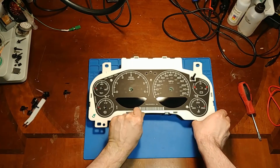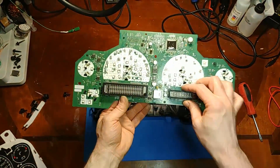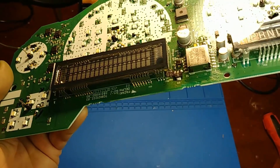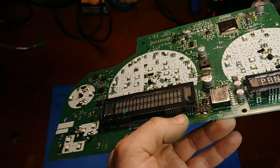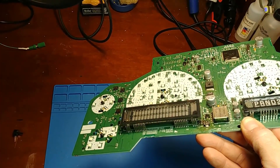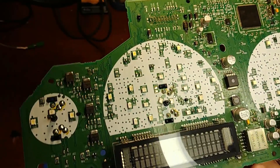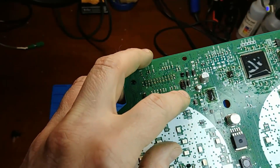So yeah, this is going to be another vacuum fluorescent display MOSFET issue. Let's get down in here. Besides a hole, we do have the MOSFET like he mentioned. These must be R96 and R97 under there that he mentioned. We can see two burnt up resistors. The foil is looking a little rough under there too. And then the diode D2 - this guy right here - he definitely had some current passing through him. He wasn't happy at all.